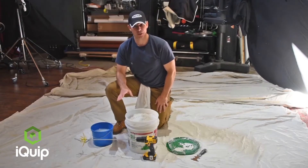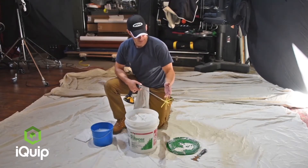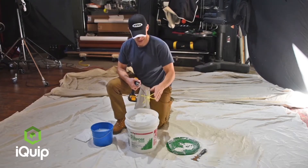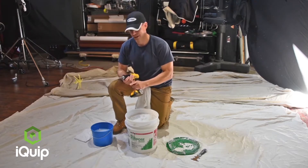The last thing we're going to show you is mixing up some drywall mud with the Stir Whip. The reason I love the Stir Whip for this is that compared to paddle-type products it takes a lot less power. Because of the thin flexible fingers, you're able to put it in there, mix the whole thing, and do it with just a regular battery-operated drill.